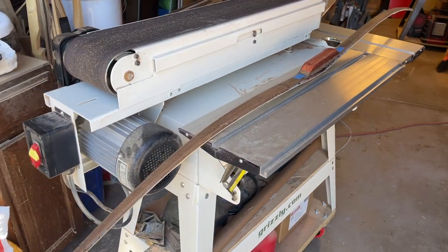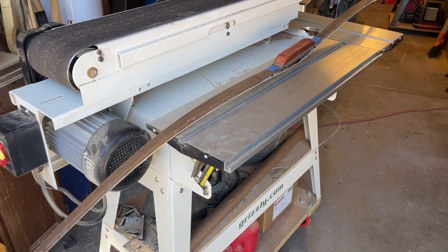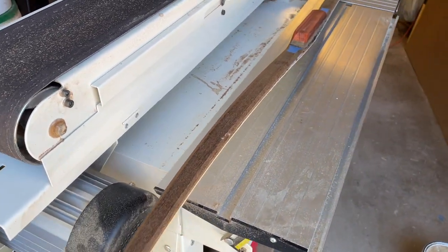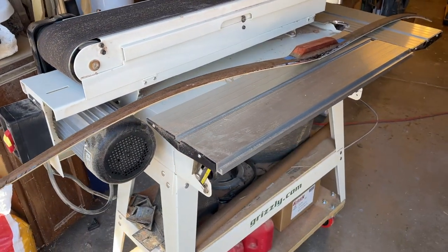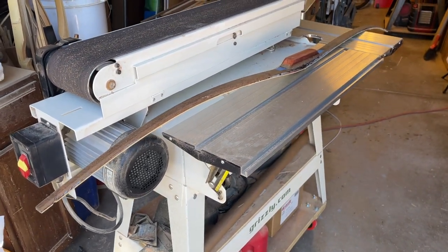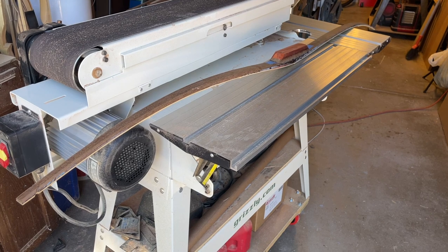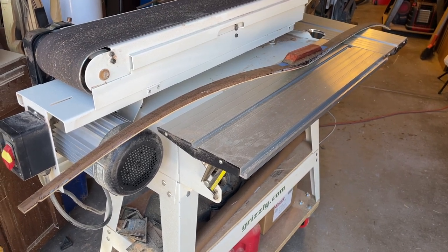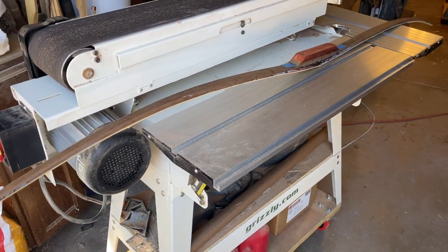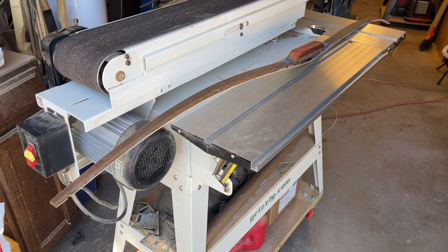So I spend a lot of time talking about getting your bow into that weight class, or into the neighborhood that you want it to finish out at, before you spend a lot of time going through the fine tillering stage. Our first goal is to at least be in the ballpark. So this bow is still really pretty stout. It's one thing to be pulling it on a tree, especially one where I have doubled up the pulleys, so I don't feel the full effect of what it takes to pull on that bow. When I get it over to the tillering stick, it's clear to me that this bow is quite stout still. And floor tillering it, it's still just a little outside the weight range that we are trying to come in at, which is between 45 and 50 pounds.